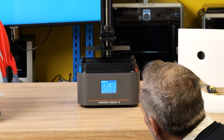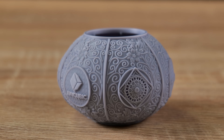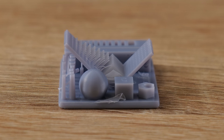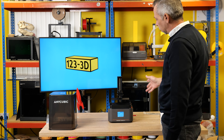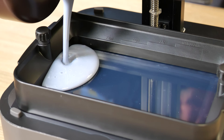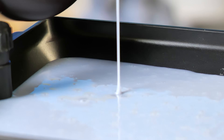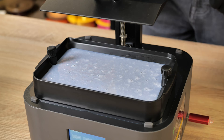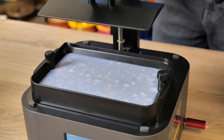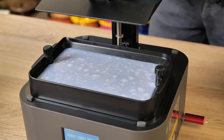Let's see what we have on the USB. We have a couple of test files — one is marked Funnel, the other is marked Test — and we have a RERF, basically a calibration file for exposure. I am not going to mess with that. I'll just put some resin in and print the test file. For anybody new to resin printing: it is really really important to give your resin a really good shake prior to pouring into the vat. As you can see in the vat we have lots of bubbles — do not start your print until the bubbles have dispersed and settled. Just pour it, leave it for a little while, let all the bubbles pop and disperse, and then you are ready to print.